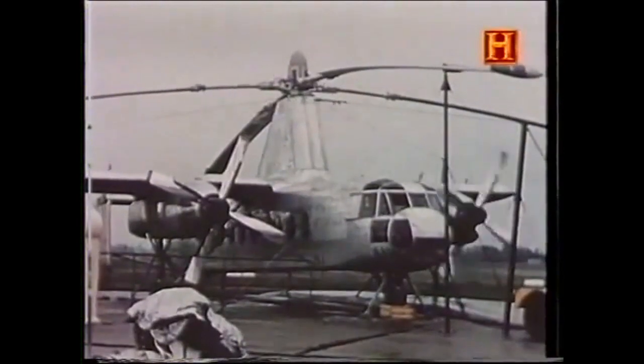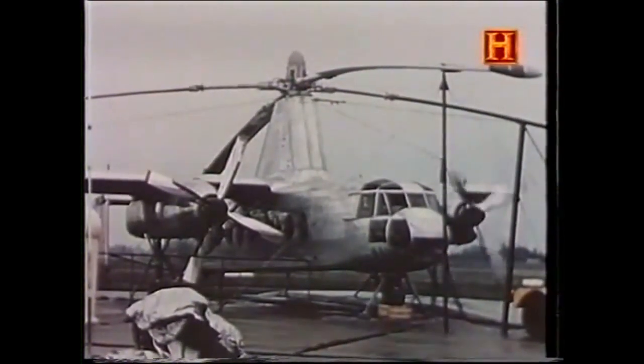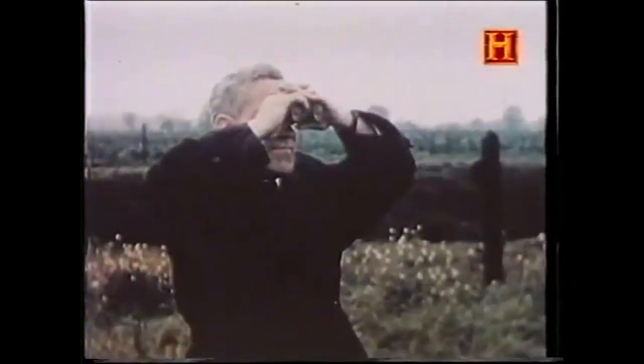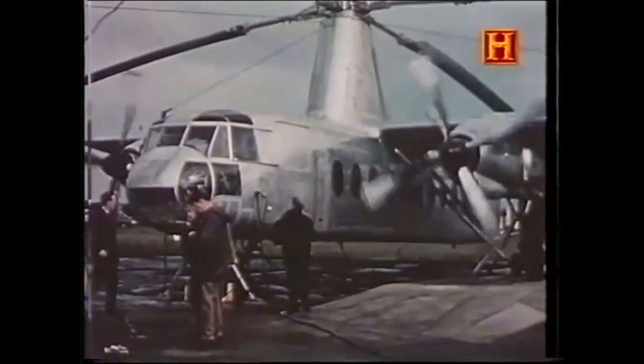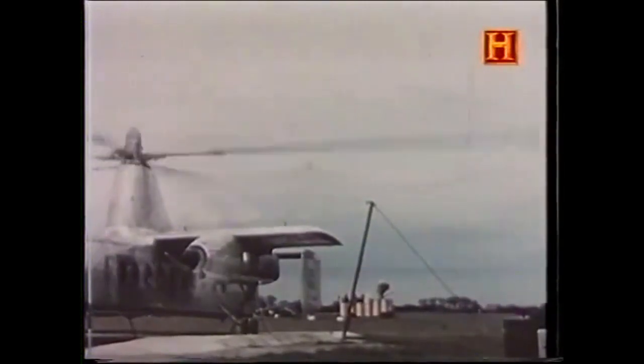The helicopter is controlling that vibration and making sure it's not going to tear the aircraft apart. You run the thing on the ground and try all the various rotor speeds and combinations of rotor speed and propeller speeds. Because the propellers are putting a vibration in, the engines are putting high frequency vibration in, the rotor is putting in a low frequency vibration. All these start to club together to give various harmonics, and some of these can be quite damaging.